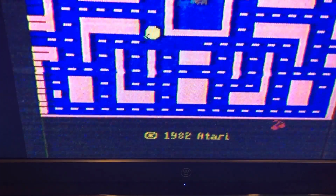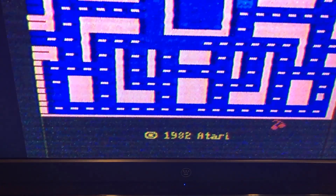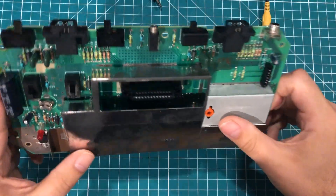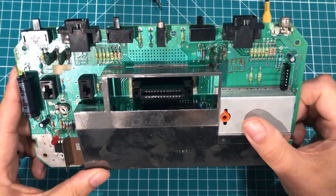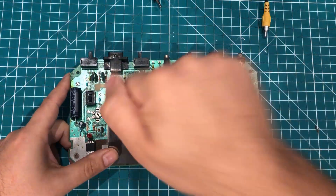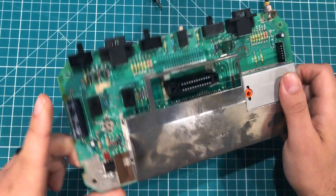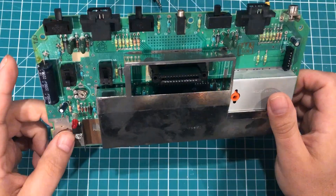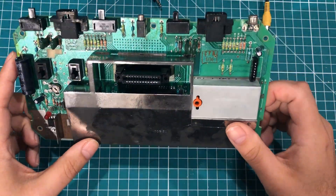As you can see it's not pretty but it is sort of functioning, which is a good sign - we're making some progress. That gives us a couple of options: we could have some bad solder joints from thermal cycling or from people shoving games in. There could also be some bad capacitors, or maybe even this voltage regulator going bad - I'm guessing that's a 7805. We'll be checking that.